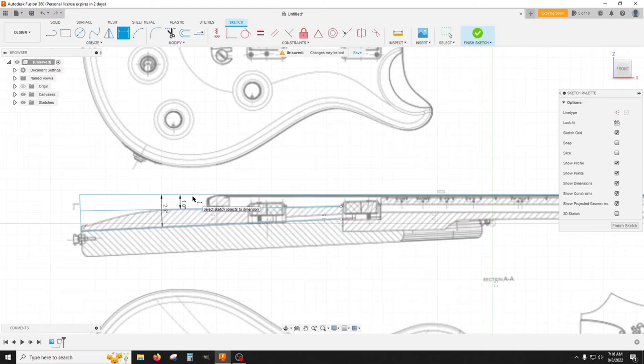This one degree is what we call the neck break angle, and that's usually compensated for right here in this joint. The floor of the neck joint is not parallel to the top — it has an angle in it so that the neck slants down, and you need that neck break angle of at least 1 degree on most every build. Even if you're using a low profile bridge it's good to have some neck break angle. And if you have a really tall bridge you'll need neck break angle so the strings come down to meet the fretboard. The only way to avoid a lot of neck break angle with a tall bridge is to recess the bridge into the top.